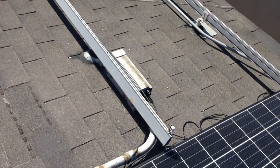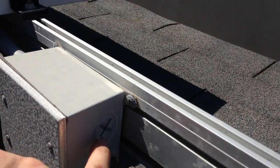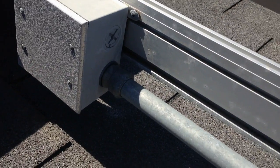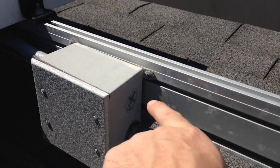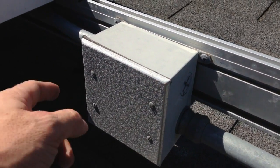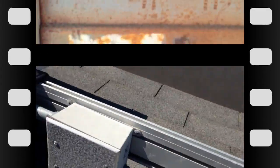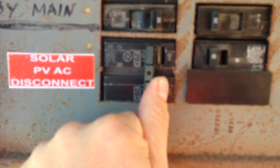Tomorrow I'll be up on the roof. Here's a close-up — I'll show you my junction box. We've got what looks like a one-inch knockout available. We'll come in through here with a strain relief, bring in our four wires, and wire nut them to the four that's connected to my number six AC wires that run straight down to the home run. Kill the breaker. The array I'm going to work on is a two-pole, 20-amp breaker, and it's where my Enphase panels back-feed into.